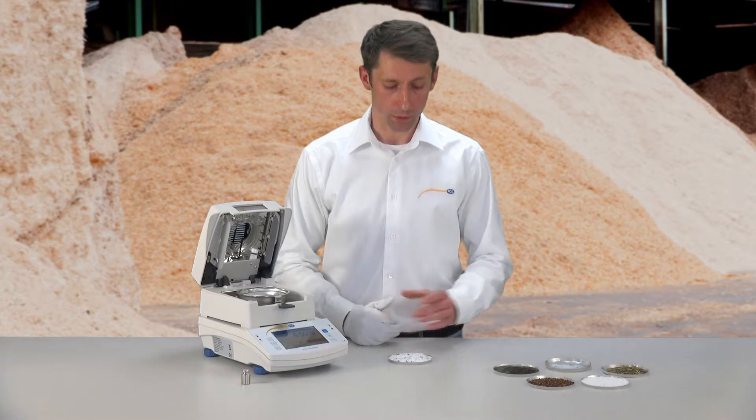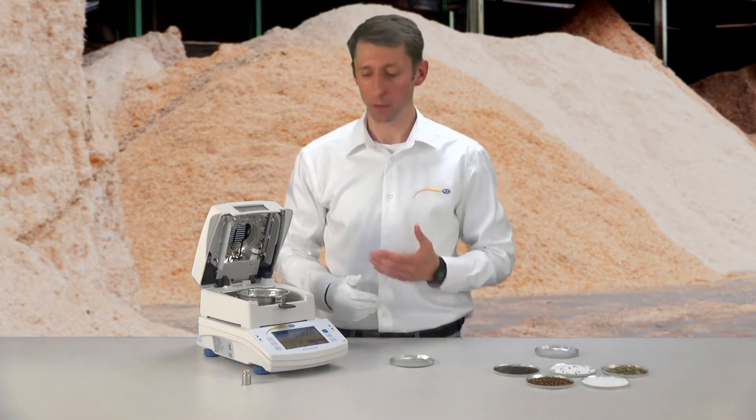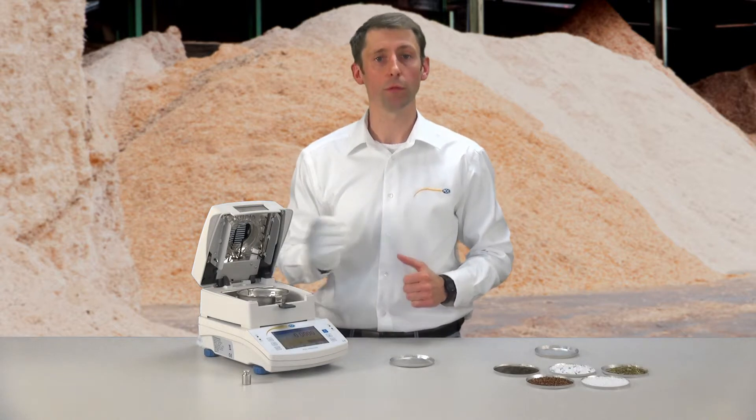By the preparation of the probe, be aware that the minimum load should be above 2 g. At best it is to layer around 10 g, so that you can use the full precision of the scale. I will now do a measurement with the moisture analyzer so you can see what sort of measuring results I get.